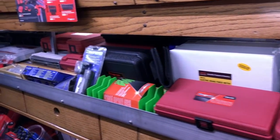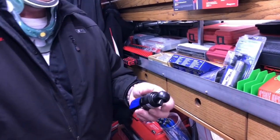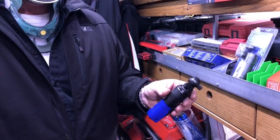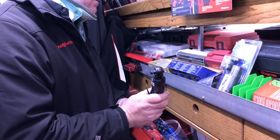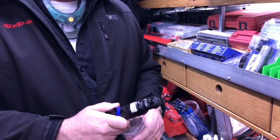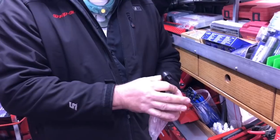These are fairly new to the product line — mini impacting air ratchets. It impacts the same as your gun does, so it won't stall out like a normal air ratchet. Small 3/8, more power. You can get them in quarter inch, same size. You get 40 foot-pounds of torque out of it, so it's not a knuckle buster. No smashing your knuckles. I like that.